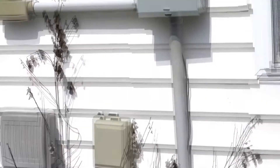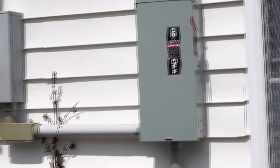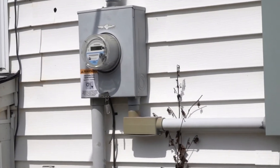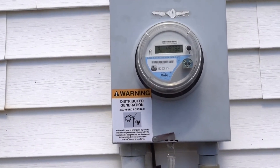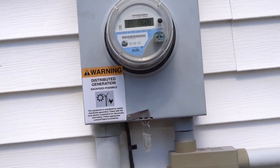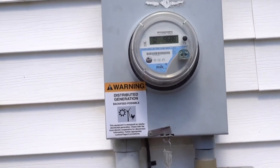There's an underground cable that comes all the way up here to our disconnect — that's the disconnect separating the solar panels from the grid, and that's where it's tied in, just right into the power meter box. We don't have a backup battery at this point; we may get one in the future. It's got a warning on there — it's a distributed generation system, which can be a risk to utility workers if they have a problem out there while this system is making electricity.